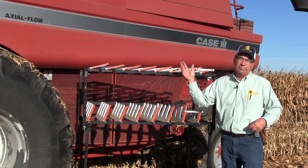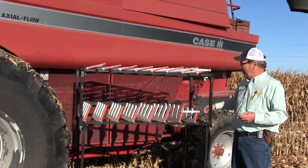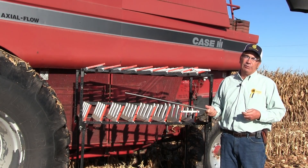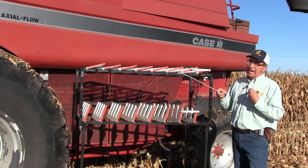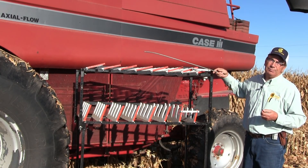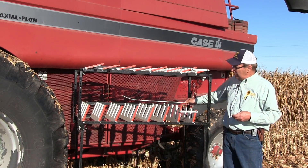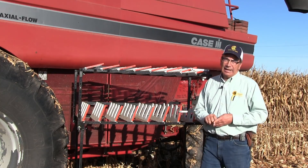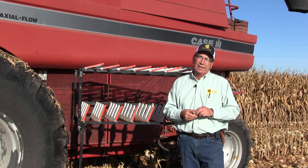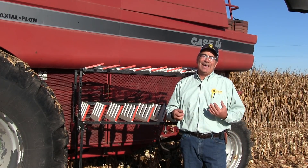It's difficult to reach the front end of the combine from the back, so this year I came up with a new gauge. It's simply a piece of 3/8-inch all-thread rod about three feet long. I can stand at the back of the combine and reach up to check the air gap between the louvers on my deep tooth chaffer. That air gap on the top sieve is going to change depending on the level of moisture and the amount of leaves, husks, and stalks going through the machine.